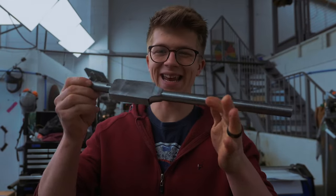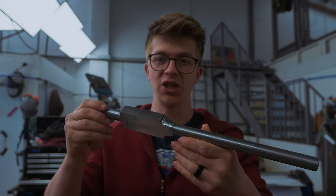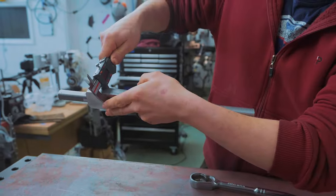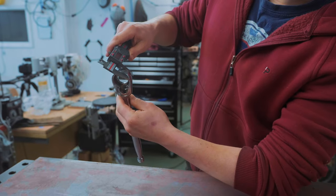So we've come out of the mill and here's what we've got. All these sides are square and parallel to each other and are running central to the round bar that we turned on the lathe. This face here we've machined down to match the width of the socket wrench that we're recreating.